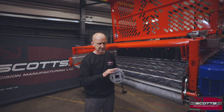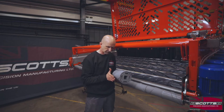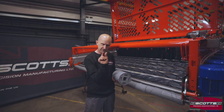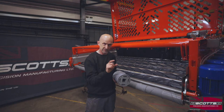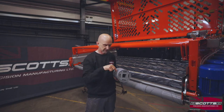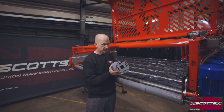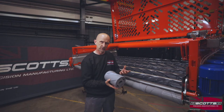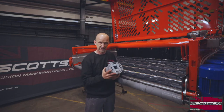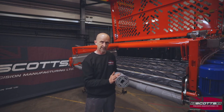The way it works better is that we're really just taking away its ability to clean aggressively. With a less aggressive tread pattern, we can get the clod roller closer to the body of the roller, so the valley rather than being square-bottomed becomes quite shallow. Small potatoes, no matter how small, find it difficult to get into the bottom of the valley and get extracted. But it still gives us cleaning — it doesn't clean as well in large clod or heavy conditions, but generally with small potatoes we're on sandier or lighter soils, probably lifting at a better time of year.